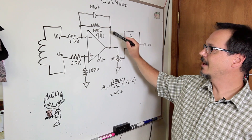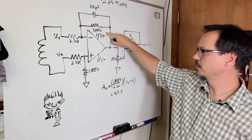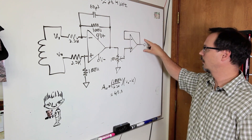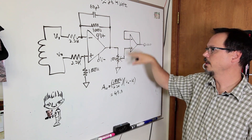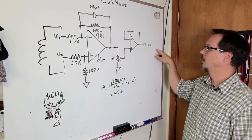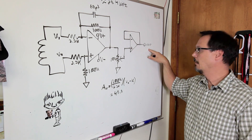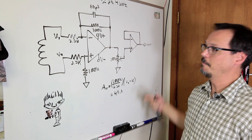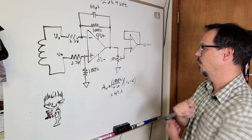However, because I did this with positive and negative voltage, I was able to get rid of a coupling cap between the two stages and at the output. Because this is referenced to ground, I don't have to AC couple the output — it's not a big deal, but I cut down on a few components.